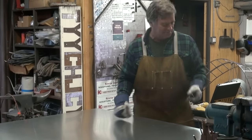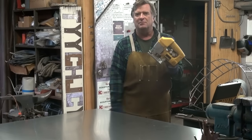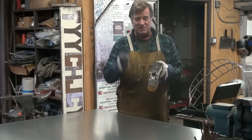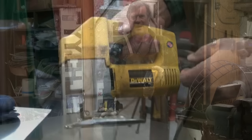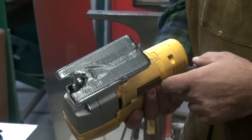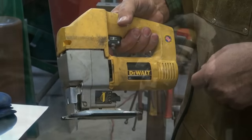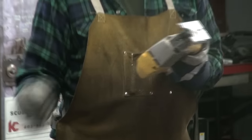You know what I'm going to do? Go old school. Plain old-fashioned jigsaw. Put a metal blade on it. Here's a trick you can use: if you're going to cut on aluminum or steel or anything and you don't want to scratch it, just get some duct tape and coat the bottom of the foot with duct tape. Now it'll slide across the aluminum and you won't leave scratches that you have to come back and grind out.